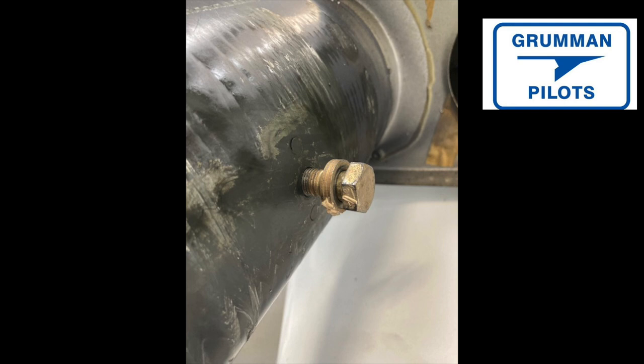The standard shoulder bolt in our wings is a 9/16-inch head, but some have a 5/8-inch head — those are the next oversized bolt. Once they get wallowed out past that, the spar has to be over-drilled and reamed to get the precision hole back. Then a metal disc goes in there, allowing you to go back to the standard size bolt.